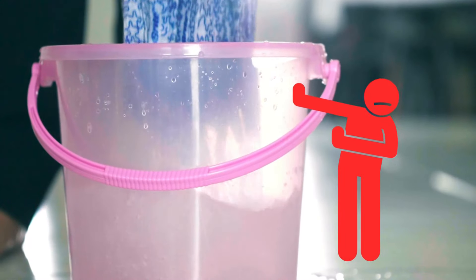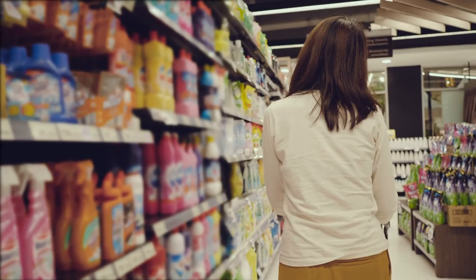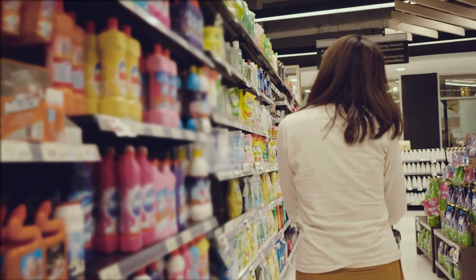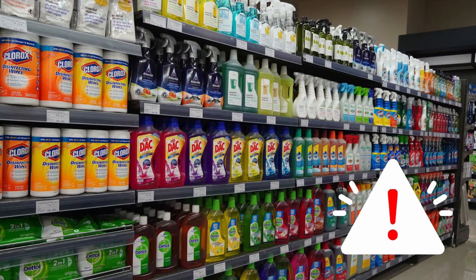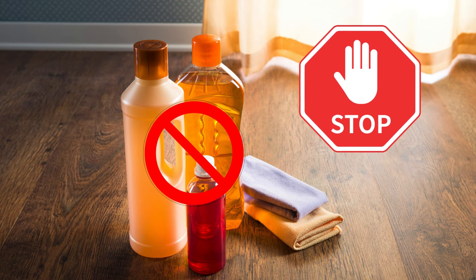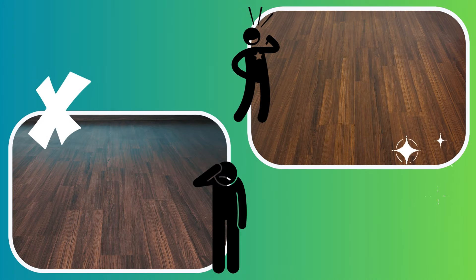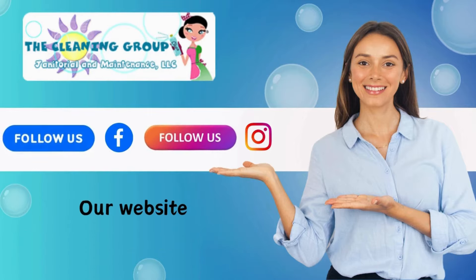As it has been well established, staying away from too much water is key. Another high priority consideration is making sure that the cleaner you select is appropriate for laminate — not all cleaners work. Oil-based cleaners will leave streaks that may be impossible to remove. And you should never wax or polish laminate, as those cloud the top layer and cause floors to lose the shine you worked so hard to achieve. For more tips and clean motivation, follow us on social media and visit our website.